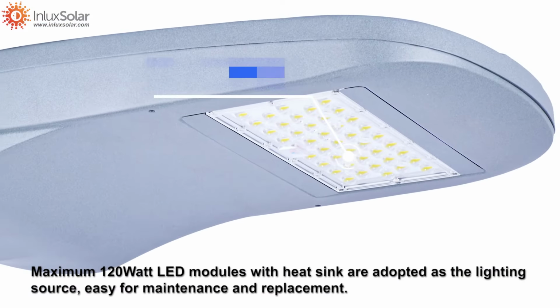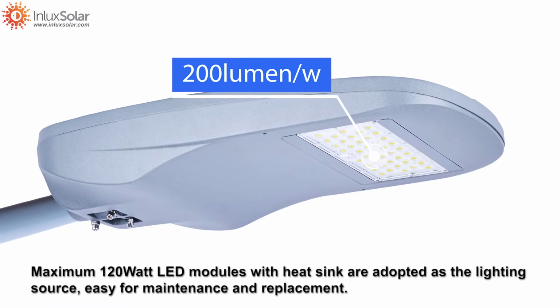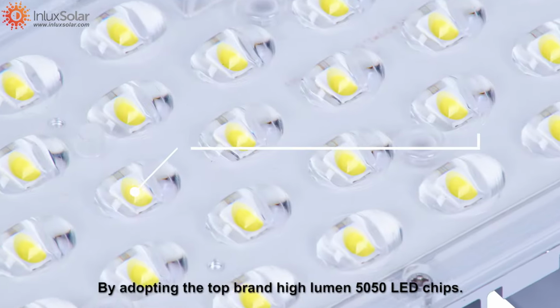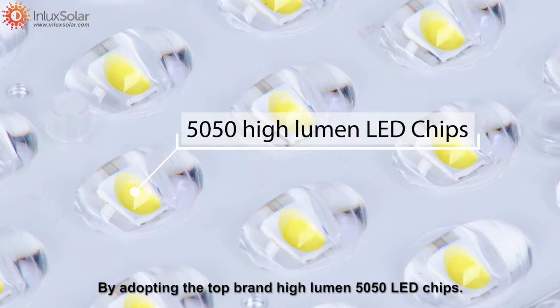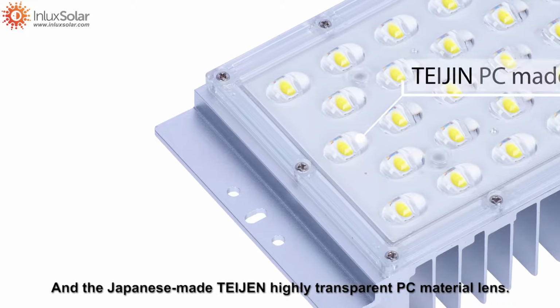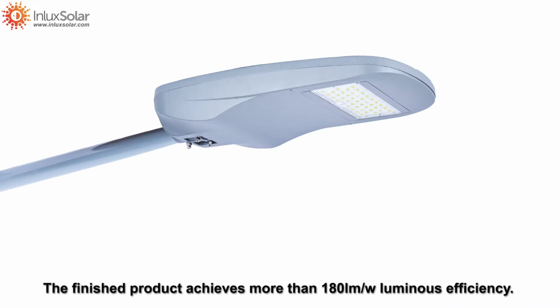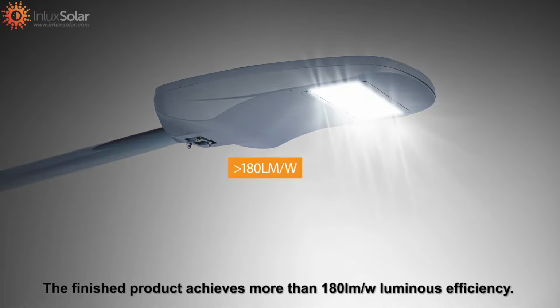Maximum 120-watt LED modules with heat sink are adopted as the lighting source, easy for maintenance and replacement. By adopting the top brand, high-lumen 5050 LED chips, and the Japanese-made Teijin highly transparent PC material lens, the finished product achieves more than 180 lumens per watt luminous efficiency.